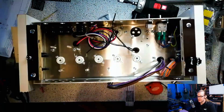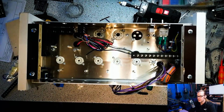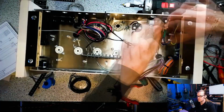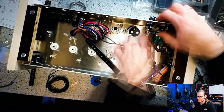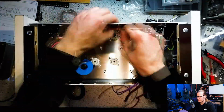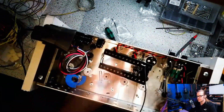And as you can see, after that I placed the power switch and attached the output jacks, because they're down under another board, and then I took care of the JJ capacitor and all the grounding spots first, and after that the fuse holders and the turret boards for the power supply parts, because this all has to fit in this right corner. It's pretty important to use good star grounding points so you don't have to bother with grounding problems, humming or something like this. You won't get small potential differences in this chassis, so use star points for grounding.